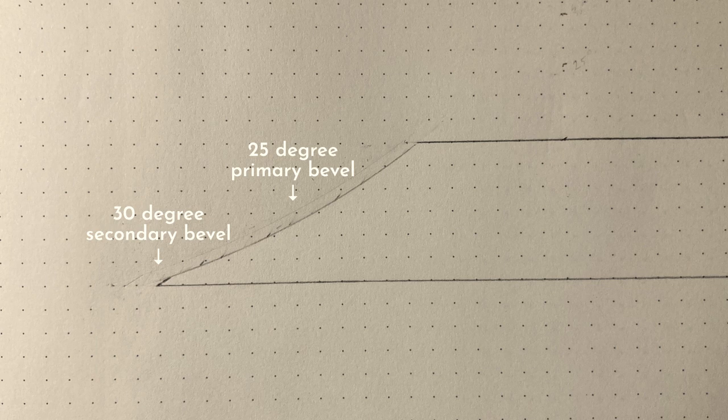Because I've increased the angle, only very little steel needs to be removed. The sharpening stones are quite fine, so they only remove very little material. Why 25 and 30 degrees? Because these angles are a good compromise between sharpness, edge durability, and ease of sharpening for most woodworking tasks. You can get great results with other angles too, but the most important thing is to settle on a primary and secondary angle and stick with them. When you do that, re-sharpening your tools will be quick and easy.